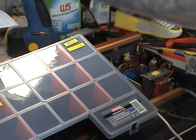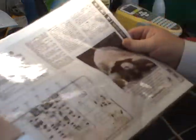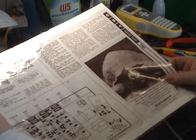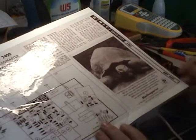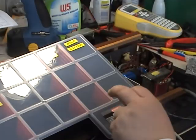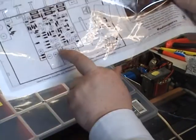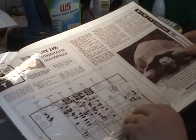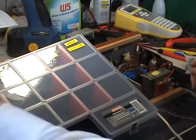We've got the ERT service sheet — service chart 1707 for the HMV Stereo Master Gramophone. On the layout we can see which capacitors we're changing; for example capacitor 22 is 450µF. The circuit diagram is also included, and for those who want a copy, I believe it's a free download on Scribd.